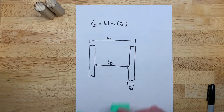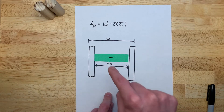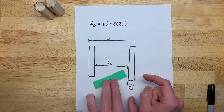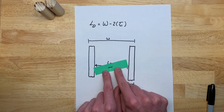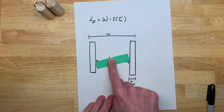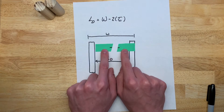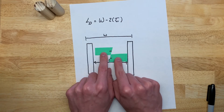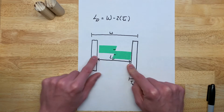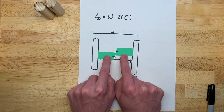You need to make each of the dowels in two halves, because there's no way you'll be able to fit the whole thing through the woofer cutout hole and get it angled in. When you try and rotate it to be perpendicular to the sides as one piece, you're just not going to be able to get it in there. So you make it in two halves with an angle on it and feed them in. You can see that the length of these two pieces is narrower than LD, and then as you slide them together at the extreme, it's longer than LD.